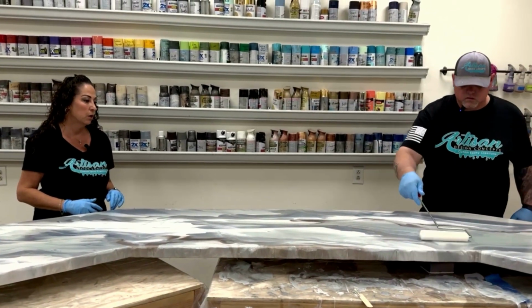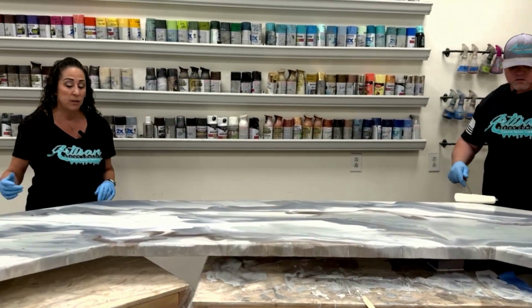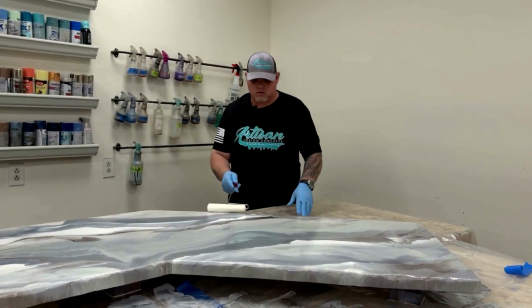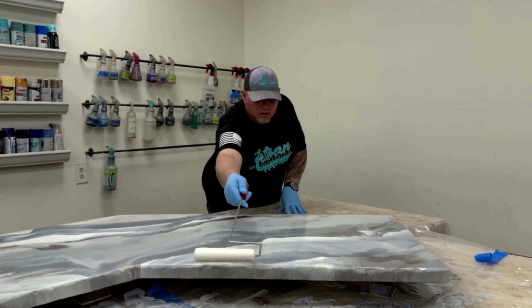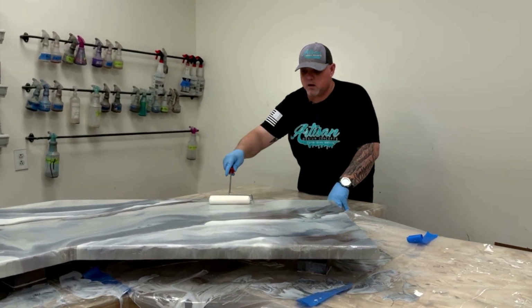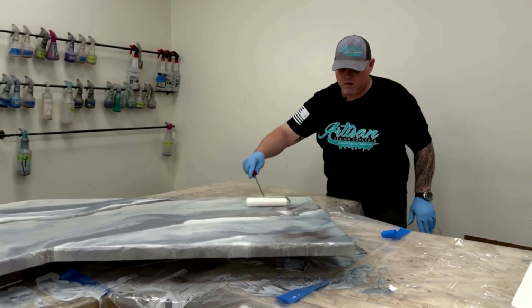You'll need to use your dry roller for the front edge. Okay, yeah, I was going to do that. You want me to roll the sample board? So this is before you do the rock edge, offloading enough material and dispersing it evenly enough on the roller that I can actually use this as a finishing dry roll for the front edge, because I'm not going to touch any more flat surface with it. So running it over a rock edge would be a good idea.